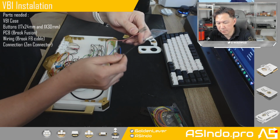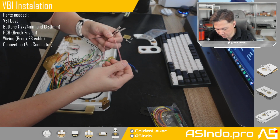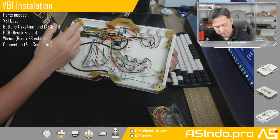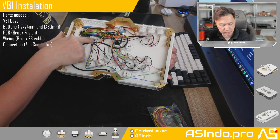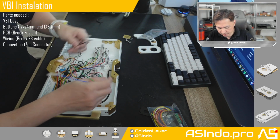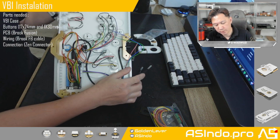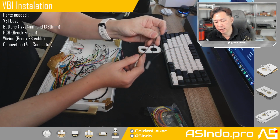Okay, so this must be ground. So green is touchpad, pink is left 3, right 3, I'm sorry, I have the wrong orientation, so the sequence is touchpad, left 3, right 3. So touchpad is green, left 3 is pink, right 3 is blue. So I want the touchpad on the bottom extra. Okay, let's install the ground first. There are 4 connectors, but we only use 3. Because the distance from the lower extra to the upper extra is far, we will skip 1 connector.